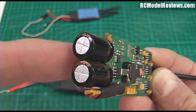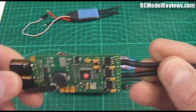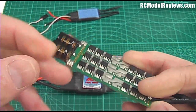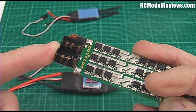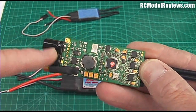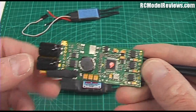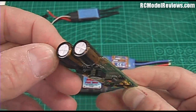On this side we've got some big capacitors — and why do we have those? Because when we convert DC into AC it creates a lot of pulses on the DC side. These capacitors smooth out those pulses so we don't get a lot of noise going back to the battery, and it also stops the switching noise from affecting the little microcontroller chip. These capacitors are what they call low-ESR, meaning they handle pulses very well — they're designed to smooth out huge pulses.